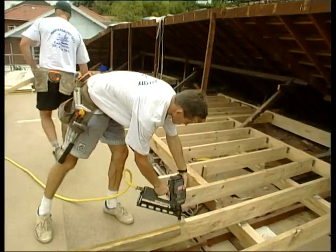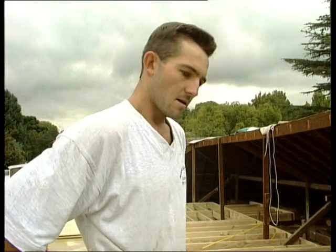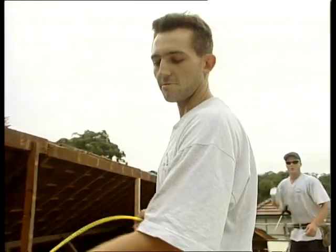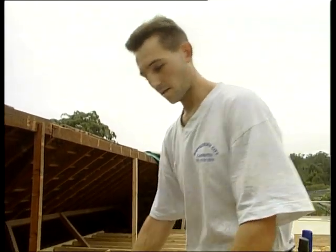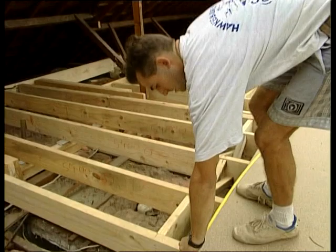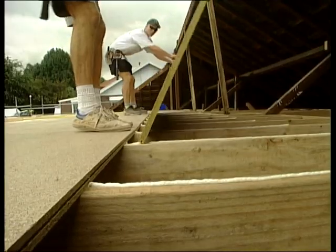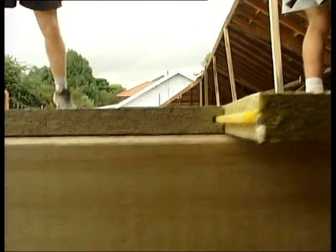You've got to make sure that when you lay this material, your floor level is spot-on and your joists are levelled and perfect, because if the joists are up and down, it's not going to be suitable. That's your tongue — it just comes out whenever you want. Sometimes you don't need it, so you just take it out. It slips in there and then your other sheet fits into that, and that's what bonds it together.